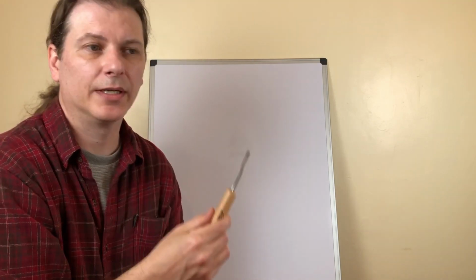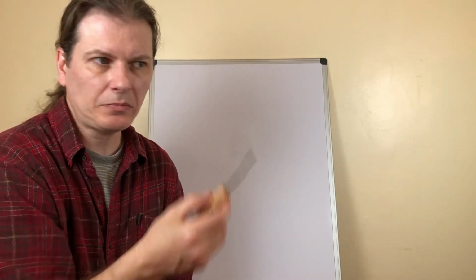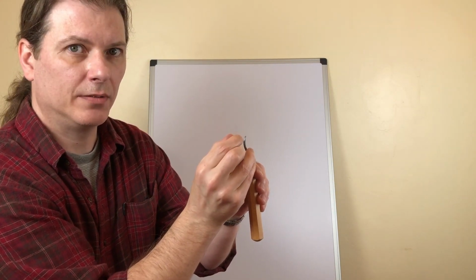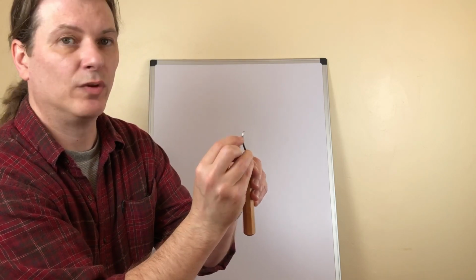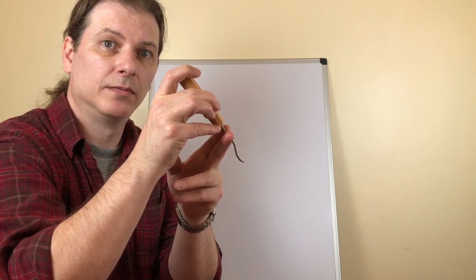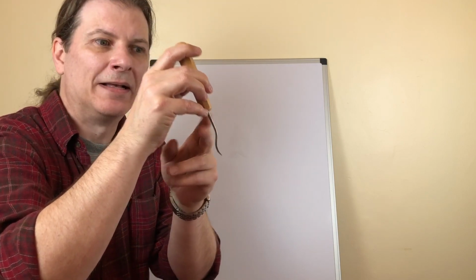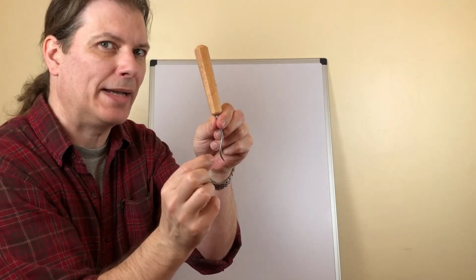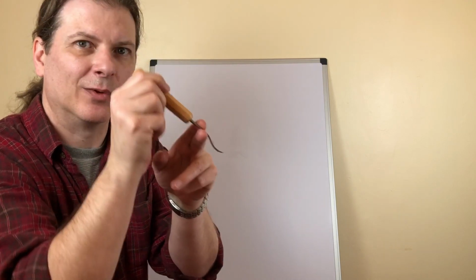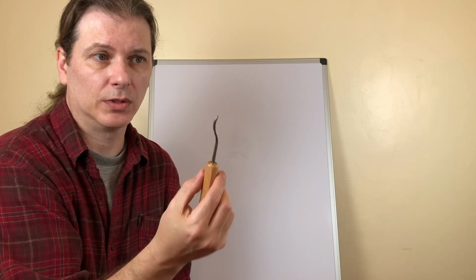I love those. And if you look at a number 27, whether palm size, micro with a short handle on it, like I've done here, or a full-size tool, then you'll notice that there's a 7 at the cut, but a graduation to more of about a 5 where the bevel meets the tool stock. In other words, there's no more bevel. And that again is so that you can go in with a graduated depth and feel. The steeper you are here, you can dig in, but as you dig in, the widening of that arc of that actual bevel is going to give you more resistance. So it's going to force you out of it, or it's going to force you to level at that depth for a given pressure. So you'll notice these things in other bevel edge tools like this.